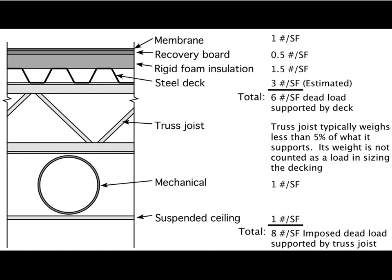In many applications such as North Carolina state jobs, we're required to include ten pounds per square foot of as yet undetermined future dead load. So even though actual loads end up around ten pounds per square foot, in our analysis for gravity loads we usually use about twenty. On the other hand, the reality is it's actually very low — like eight or ten pounds per square foot — while uplift forces from wind can easily be double that, or near the coast quadruple that.